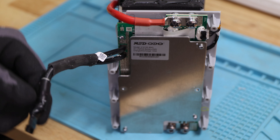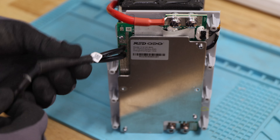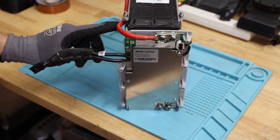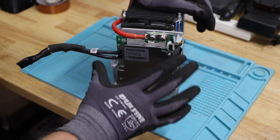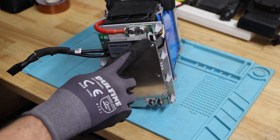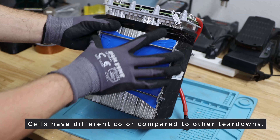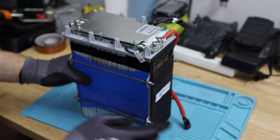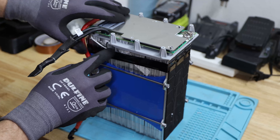We have the negative wires — two of them — which crimp together to the terminal here with a protective sleeve. Then we have the positive wire over here, also zip-tied to the side, going to the terminal. On this side we have the BMS itself. It looks like some kind of bracket, which looks pretty nice. We also have the balance wires here. You can see all the pouch cells — they are compressed here with a rod. There's also separate blue shrink tape. I can see some temperature sensors on the BMS as well.